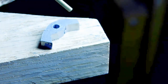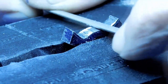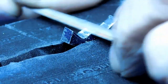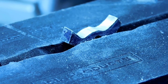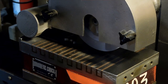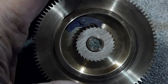There's the basic shape of the click. I've moved it over to the vise in soft jaws and I'm using a file to get it to its final shape, taking it out several times to match it against the ratchet to make sure I'm in the ballpark. Once we get it to the basic shape we want, we move it to the surface grinder to get it to the height needed to fit in the recess correctly. A couple passes on each side cleans it up nicely. There it is — the ratchet wheel and click together in the recess and the great wheel.